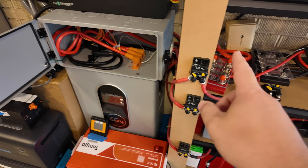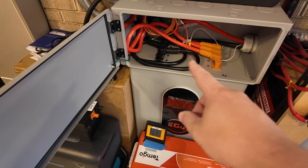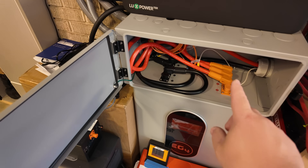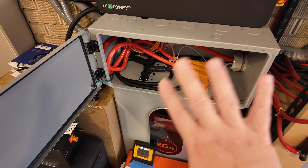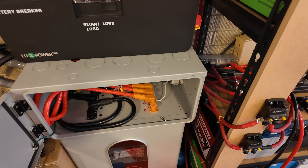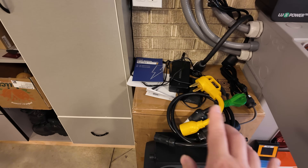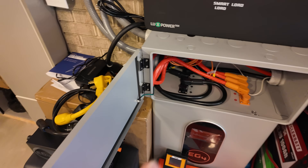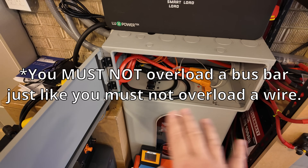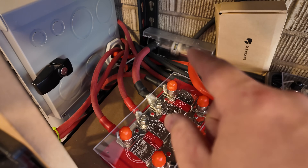The reason I used a 200-amp fuse is unique to my setup. This power comes in and feeds onto the bus bar of this wall mount battery, which is rated to only 600 amps. The wall mount battery can supply 200 amps to that bus bar, leaving 400 amps to work with. Bringing in power from the tower of power adds another 200 amps — limited by that fuse. A third wall mount battery will fill the last two ports and max out the 600-amp rated capacity on the bus bars inside. That's why I derated the size of that fuse.